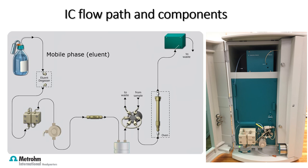We have just discussed the preparation of the eluent which is used as the mobile phase. The eluent is first degassed to remove any air that may be present. The eluent is moved through the system using a pump. The high pressure pump is a serial dual piston pump which moves the eluent at a specific flow rate. Next, there is a purge valve which is used to remove any air bubbles in the lines whenever fresh eluents are prepared. This is followed by an in-line filter to remove any contaminants from the eluent, which protects the columns. Next, there is a pulsation absorber which smoothens the pressure variations caused by the pump and the injector valve.